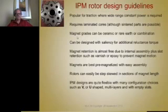But the magnet grades could be ceramic, as we looked at, if they're V-shaped, or another possibility we'll talk about in a minute. But usually they're rare earths. The part we'll talk about is a combination. You could configure this with a layer of rare earths and a layer of ceramic to reduce the cost of the rare earth. I haven't seen much work done on that, but I expect there'll be a lot of work done.